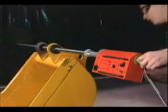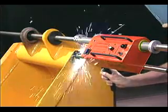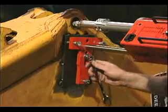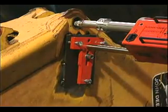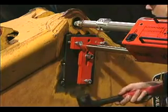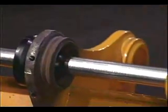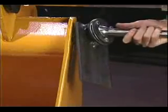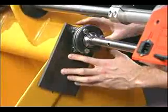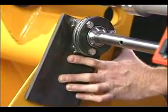Depending on your application, the BOA can be mounted to the workpiece using the supplied tack nut and may be centered with a boring bar or any inch-and-a-quarter pipe. The optional T-base provides adjustment for manually achieving parallelism and concentricity. When two or more inline bores are to be repaired, a centering cone and rod set can be used for easy alignment. The optional ball mount allows for infinite adjustment of the tack plate, very handy when the mounting surface is not exactly perpendicular to the bore hole.